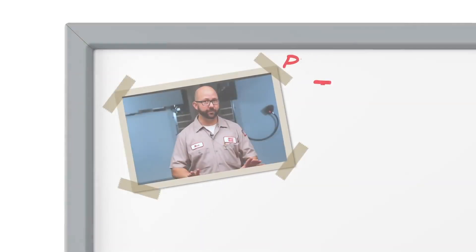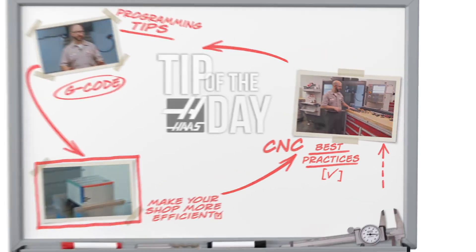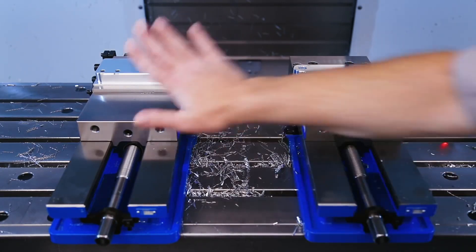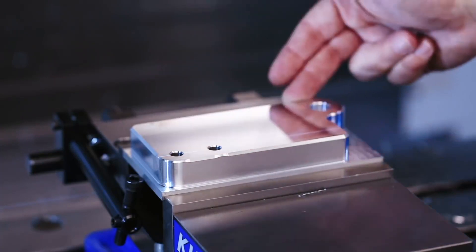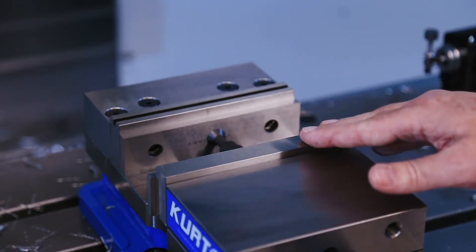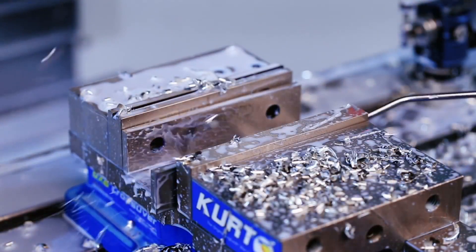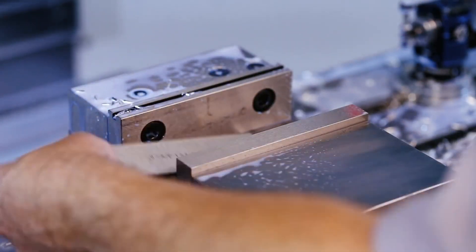So stick around. Everything for me begins with my setup sheet. I've got a block loaded up. This is a common setup for a vertical CNC mill — two vices, a first operation and a second operation. If my parts have long parallel sides like this one does, then I might as well just hold that second operation in a vice with hard jaws being supported from underneath by parallels. I'll also make use of a parallel keeper to make sure those parallels don't go flying out when I blow off my parts, allowing chips to settle behind there.